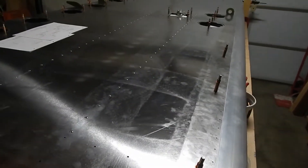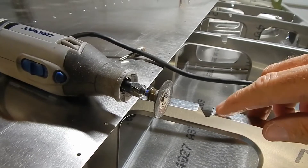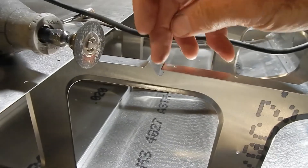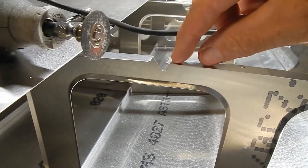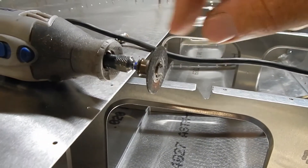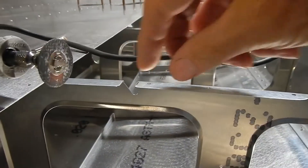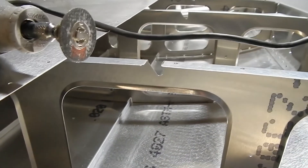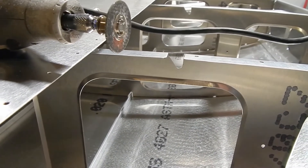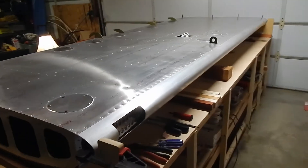I'm throwing this in case any of you run into it. I went in with my Dremel and cut back the notch line — the notch that didn't come far enough forward. I just took the Dremel and cut about an eighth of an inch, roughly the width of the cutoff blade — a very small amount — then buffed it smooth. I did that to the ribs going down just to open the gap a little, and that fixed it on the other wing. I'm sure it'll fix this one too.